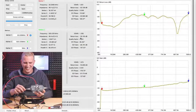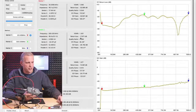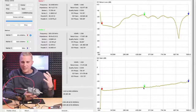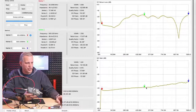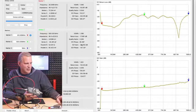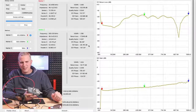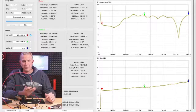This is test number 10. This is a new test. Check that out. It's just like you said, John. If we look at our insertion loss, first of all, instead of being flat, we have positive tilt on the insertion loss. And on marker 2, instead of being 17 dB, we have 28 dB of insertion loss. So to your point, if you put this tap in reverse, if we just flipped it around the wrong way, you're going to get a lot more insertion loss on this tap than what you